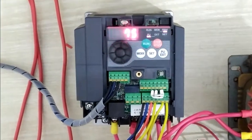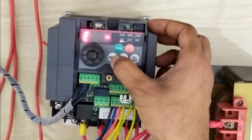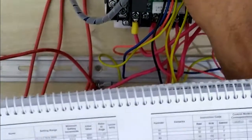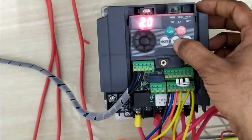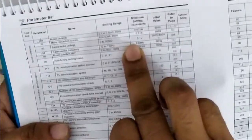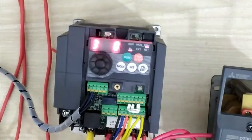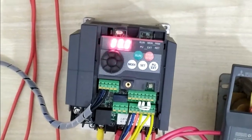AT1 must be similar to the load — our minimum is needed, not maximum. The next parameter is motor excitation current — AT2. AT2 shows 2 ampere, which means our load is at no-load conditions. AT3 is rated motor voltage, which should be 380 volts for our load. You can see it is set to 380 volts as the rated motor constant value.